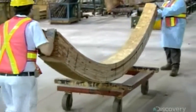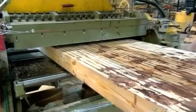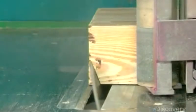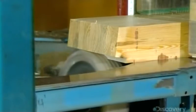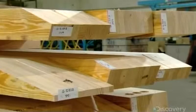However, there are still several more steps to go. A two-sided planer simultaneously finalizes the dimensions, evens out the ends, and removes excess glue that oozed out under pressure. Next, a computer-guided multi-tool machine cuts, drills, and notches the beam according to the customer's technical drawing specifications. Then each beam gets a tag indicating the order number and part number.